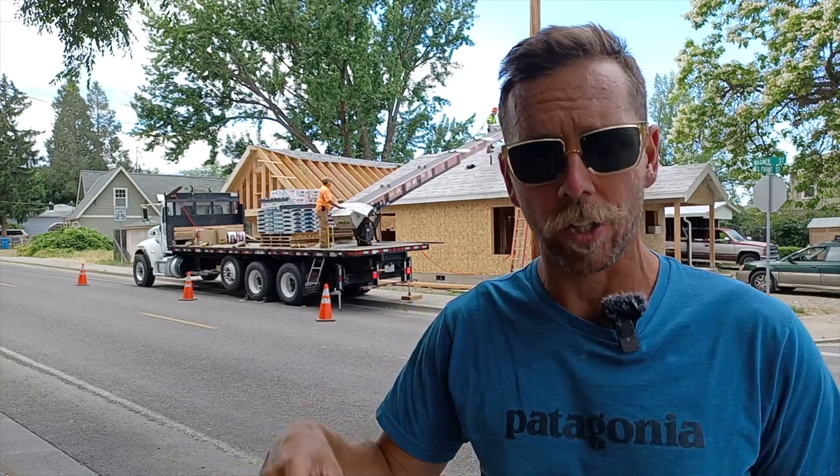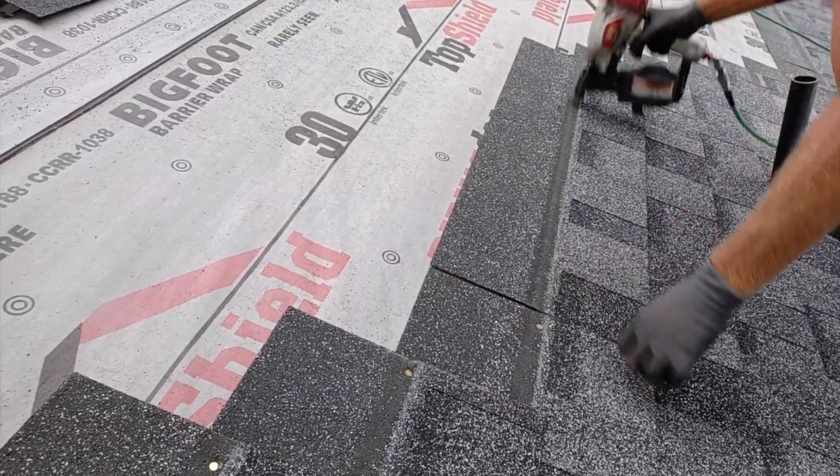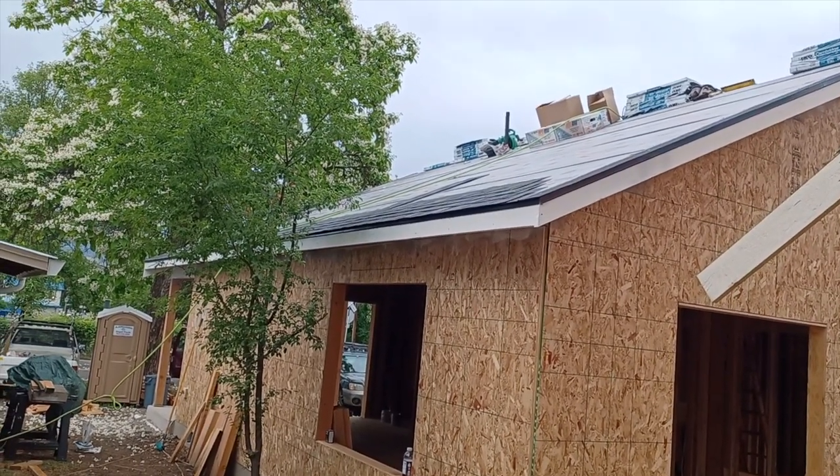This is an awesome tool — it's a belt boom. The roofing warehouse shows up and loads all our comp shingles, nails, ventilated ridge, and ridge cap up on the unit so we don't have to carry anything up a ladder. Having the relationships to make a call and get this truck out here is really important. If you don't have those relationships yourself, that's where picking a builder with local market connections comes in. Windows are showing up this afternoon — we're going to do house wrap and throw the windows and doors in to have these places buttoned up and lockable.